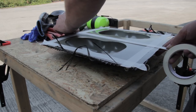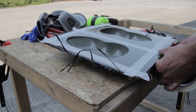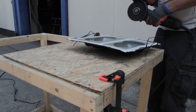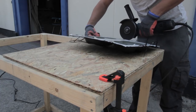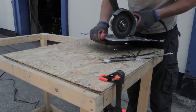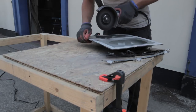I'm using tape as a cutting guide — it's fast, easy, and gives a good visual mark for trimming. From this point I'm using the 3M full-face mask; I previously used a half mask but had problems with dust getting under the glasses. It's a big improvement for safety, because carbon fiber dust and epoxy resin particles are very nasty. I'm using an angle grinder for rough cuts — I used to be nervous about it, but it's much faster than a Dremel.